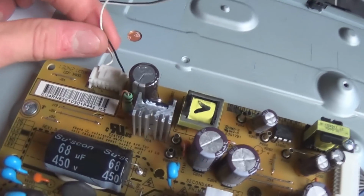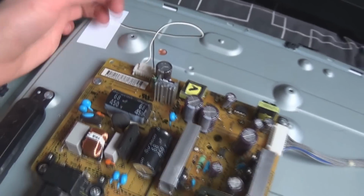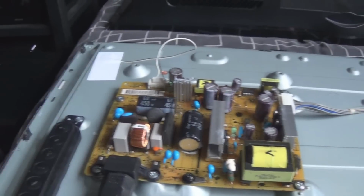So I was checking out the power supply, and the LED Plus should have, when this thing is working, and they actually label the output on this, the LED output should have 70.3 volts on it. I was only getting 48 volts on the white connector there, which told me straight away the LED booster is not working. I have my black probe of my meter on chassis ground here, and my red probe on there, and you should still see the same voltage.